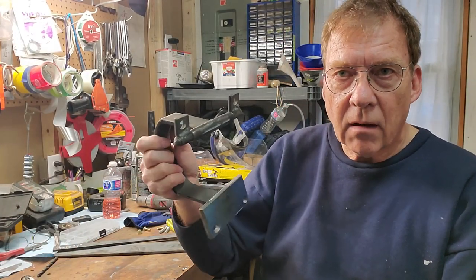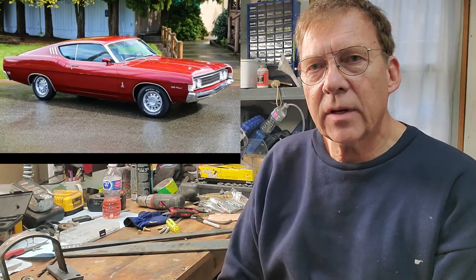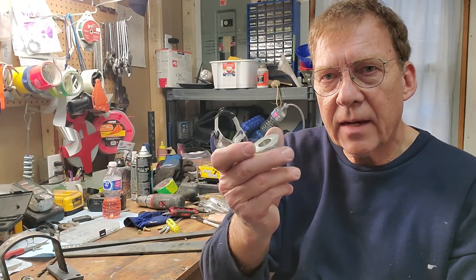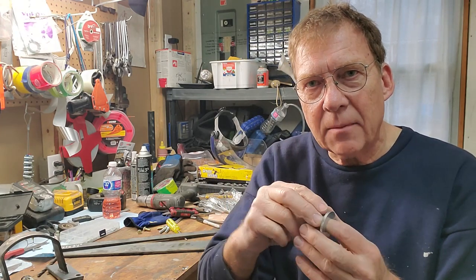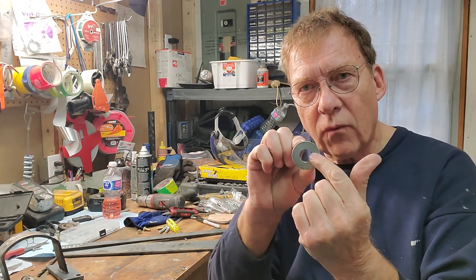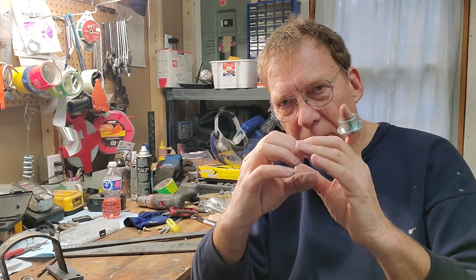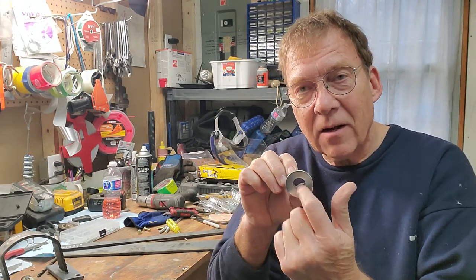Before we get on to working on the hinges, I'll show you why we have to rebuild this hinge. There's another thing I was working on — my brother's vehicle. If you remember from my past videos, you're going to see a video about a 1969 Fairlane Cobra. This is a 428 Super Cobra Jet four-gear car — it's a beautiful car, but it's suffering a problem that these older vehicles start running into: the bushing that the clutch pedal pivots on wears out and gets sloppy. The metal that the bushing is installed in is really thin, and the amount of pressure and the number of times you press the clutch pedal means you not only create an oval in the bushing, you create an oval in the metal.